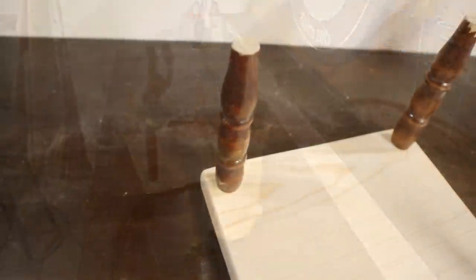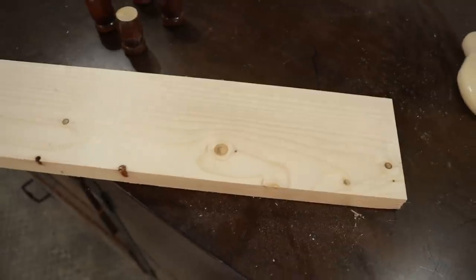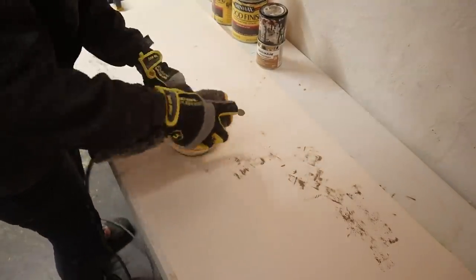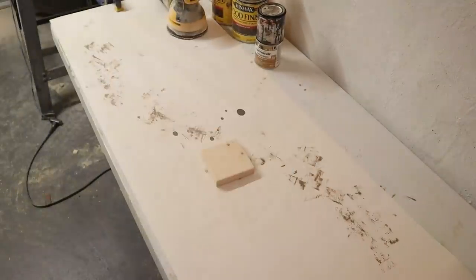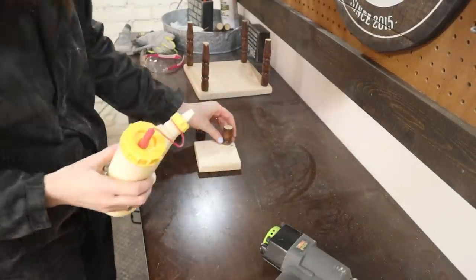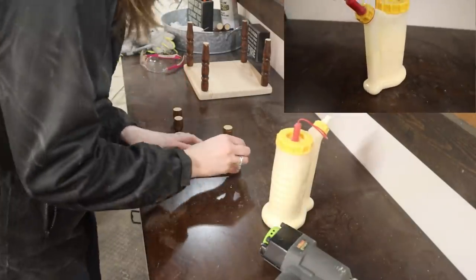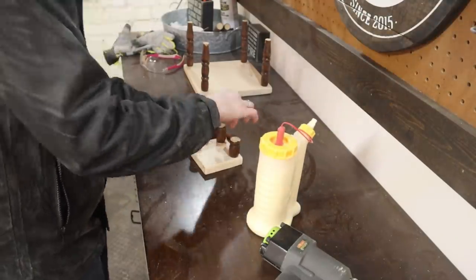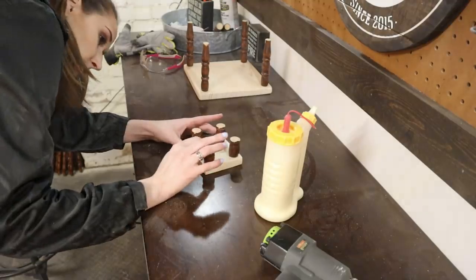Here are those cute little spindle pieces that I cut off. I'm using a 1x3 as the top, so I just cut that down square like I did the bigger one. Again using 80-grit sandpaper, I'm rounding out all the edges and corners and making sure the top and bottom are nice and smooth. I'm using my glue bot again — I'll link it in the description below; it doesn't clog and holds lots of glue. I'm applying wood glue to the spindles and attaching them to the wood piece, letting those dry before I attach them.